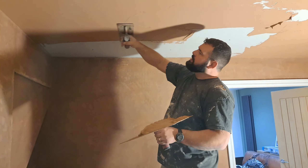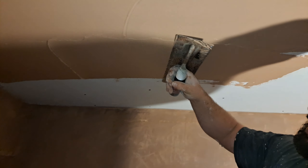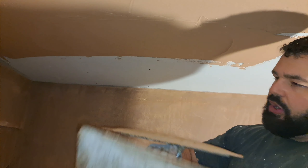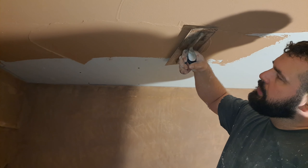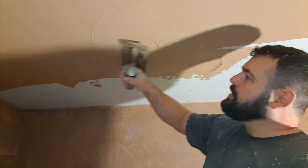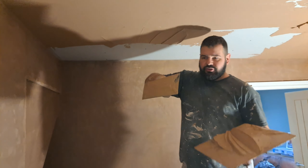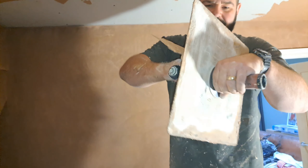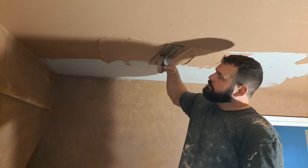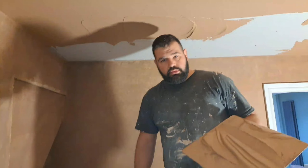The trowel just rolls — come closer so you can see. What you're doing is you're not digging back in like that, which all beginners seem to do. You've got to roll the trowel so you're coming back. Watch: it rolls and then folds. It's just something you've got to practice — just roll the trowel. If you look at the end of the trowel it's got a slight curve and there'll be gear on the back — that's what you're actually rolling.